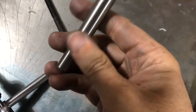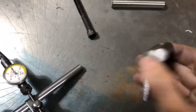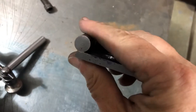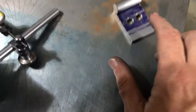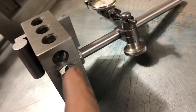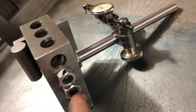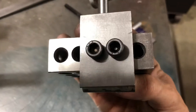This starts with a half-inch ground dowel that I brazed onto this piece of flat stock. I did use my friend's drill press to bore some holes in those. The holes here are designed so that they fit in the cross holes in a 1-2-3 block.